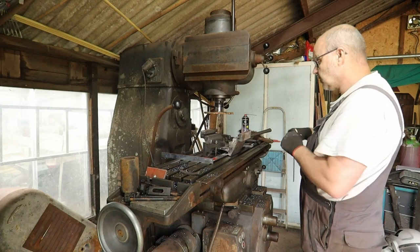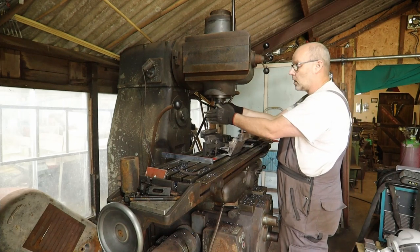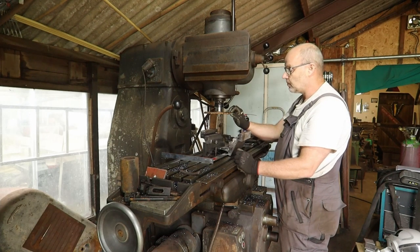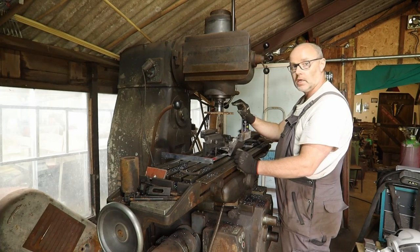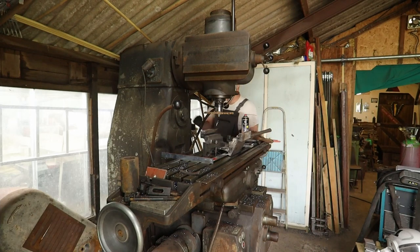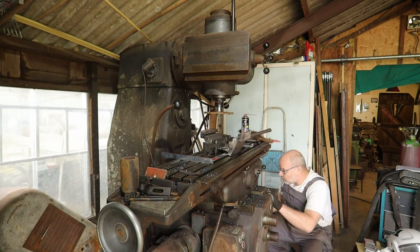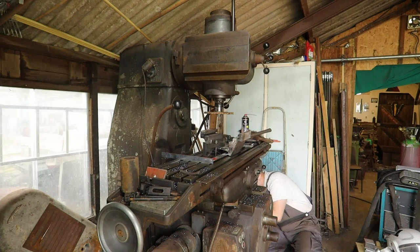That's good. So when I'm cutting like this, because it's way larger, the RPM has to go down, but also because it's a hardened cutting face, instead of the plates you can exchange, they also need a lower speed. And also the feed rate has to be low enough. So check that one too.